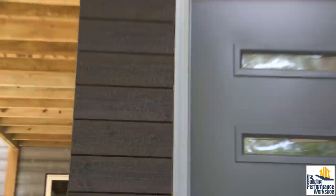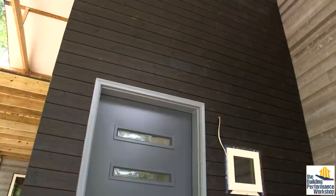The inside corners — I instructed the siding crew I do not want to trim this. As I've said in other videos, trimming this house forever could end up being a 10 to 20 year process; there's always something else to trim. I want this house to work and be a beautiful place to raise our daughters. So inside corners can be cut so that they're perfect. I told them that's what I wanted and in some cases I had to come along and say, 'Hey, can we make that a little tighter?' You want to maintain that eighth-inch gap. I'm also going to show you the eave-to-wall connection, which I also did not want to trim, and that worked out perfectly.